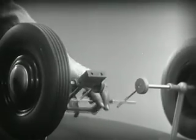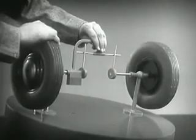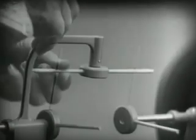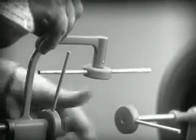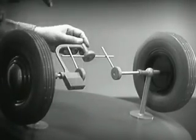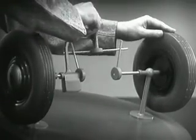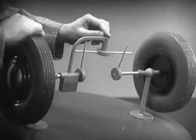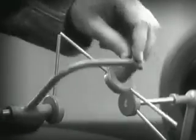Stop one wheel, the other wheel won't budge. Let's put this bar on a pivot, so that it can swing in either direction. Now, the bar can still turn both wheels at the same speed, and because it pivots, it lets one wheel turn even when the other is stopped. But if turned too far, the bar will swing around until it won't drive the spokes that turn either wheel.